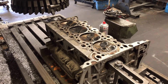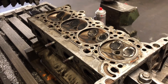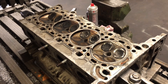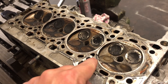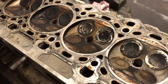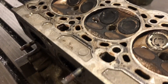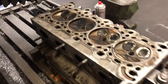The reasons why we do it: when a cylinder head comes off for refacing, it means the head gasket has either started to blow or has blown. Now you've got two different types of head gasket — a fiber gasket, which a lot of the older petrols use, and most stuff now uses a multi-layer steel gasket. If you look on the cylinder head around where the gasket line is, that's where the gasket seals around the head. You can see a clear line, and in areas like here that have gone black, that's a telltale sign where the gasket has started to blow. Usually these little petrols have a water jacket there and that's where it blows into.